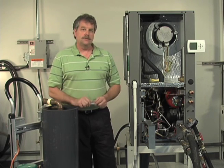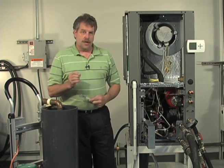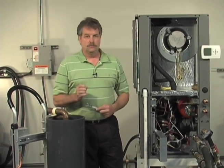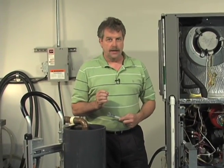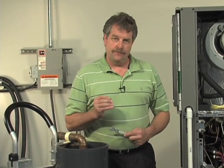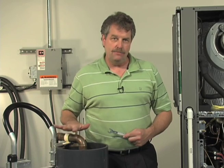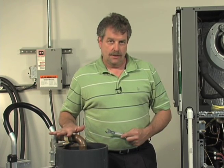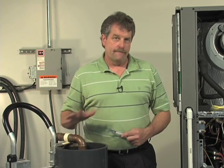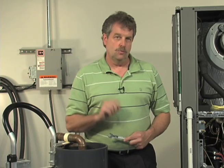Guys, I can't emphasize enough. Be patient. Go through all the steps to verify you have successfully removed all the air. No one wants to come back and try and explain to the homeowner why they're back doing it again, especially if you kind of rush through this. This doesn't have anything to do with how much time you spent. It has everything to do with verifying you removed all the air from the loop and from your heat exchanger. So again, guys, do it right, do it once, do it well.